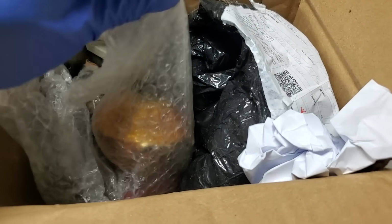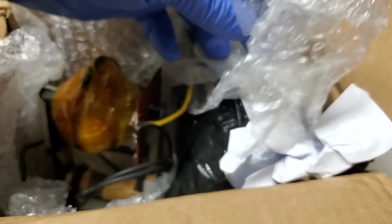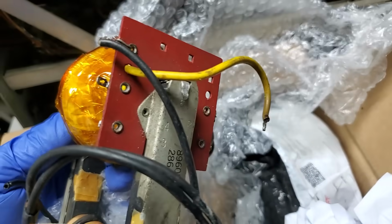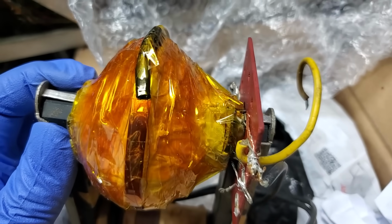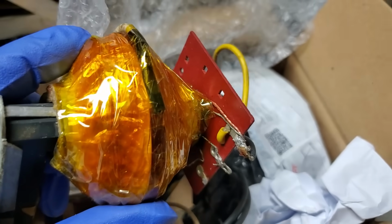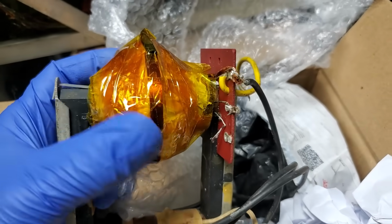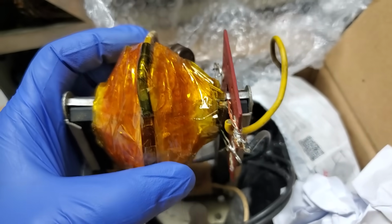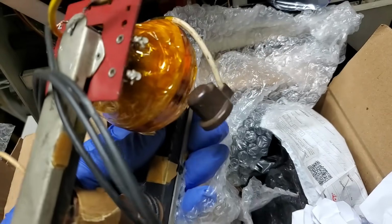So here's the flyback with the secondary rewound with modern synthetic insulation. He did not solder the wires back on for the primary. He told me that this is a Packard Bell flyback, and you can see the stack of wire there, the winding. That's pretty interesting. Now theoretically, this should never fail again like this. The insulating capability of this tape far exceeds paper, especially when paper is damp. But yes, so this is an experimental deal.